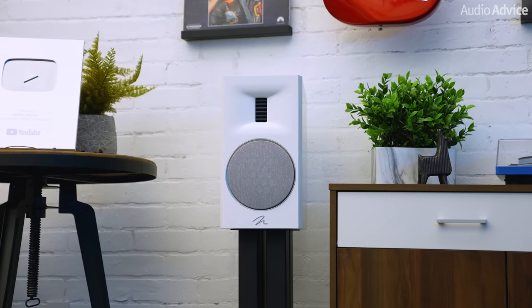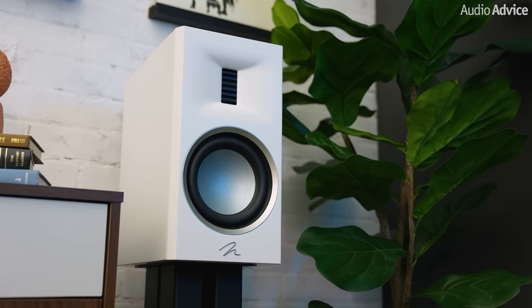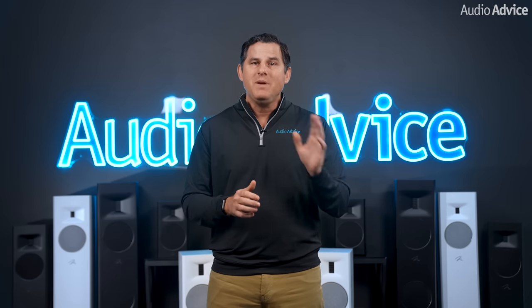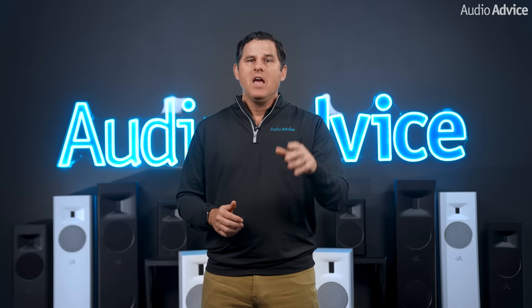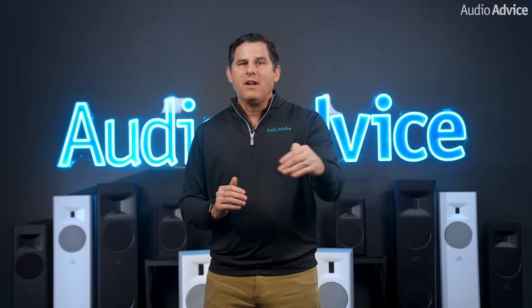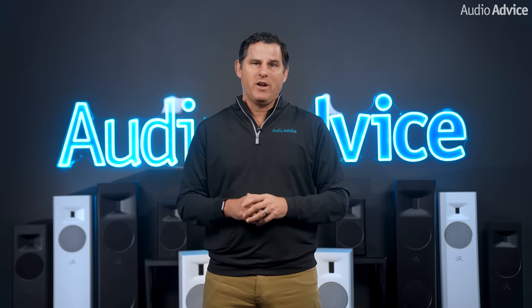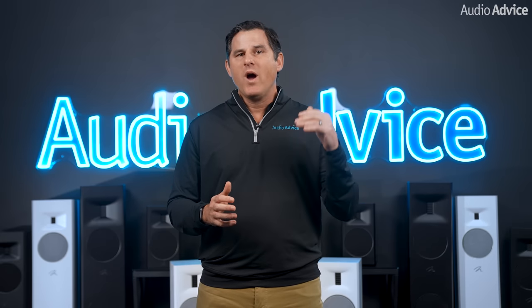The bookshelf model in the XT line is called the XT-B100. You get the 6.5-inch Nomex reinforced Kevlar driver paired with a much larger XT Motion tweeter. Sensitivity goes up to 93 dB, and the low end is much deeper than the B10 with a spec of 45 Hz. We compared the B10 and the XT-B100 side-by-side and felt the XT model completely blew away the B10 — the bass went far deeper, but that added bass along with the better driver made voices and instruments in the mid-range sound far more accurate. If you're looking for a bookshelf stand-alone speaker, spend the extra 20% and get the XT-B100. We also tested it in a really large space and it had no problem putting out a big, very fulfilling sound. The model is one heck of a great value.